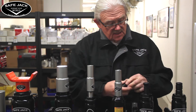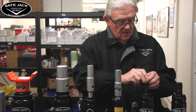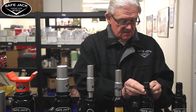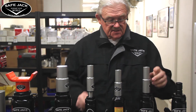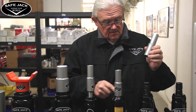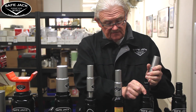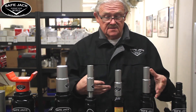In this case, we can screw out the extension screw on the jack, apply the collar, get an O-ring over the top — real simple like this, just rolls right on. Now the extension fits. You can see these are essentially at the same height, but this jack hasn't used any of its stroke yet to achieve that. So this jack will be able to lift an inch and a half higher than this jack will, just because of the extension screw collar.